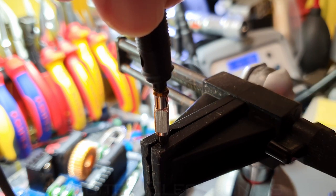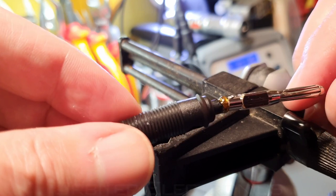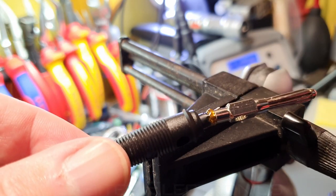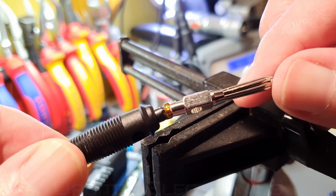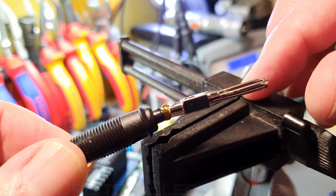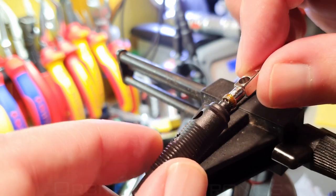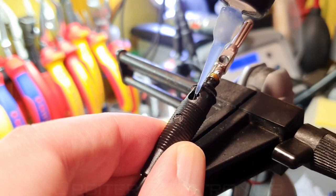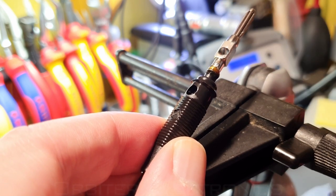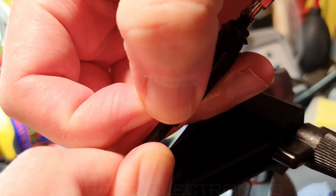Now inside that crucible, I rotate my hand anti-clockwise, dip the end in there and start turning clockwise as I push down very slightly. You can see it just go in like that — keep turning clockwise, then pull the soldering iron out at the last minute so it sinks right into the hole and the solder is pushed out. After about 20 seconds I loosen it off and we should have a solid connector. Obviously it needs to be cleaned up — it's full of flux — but that's how I do those connectors.